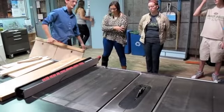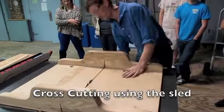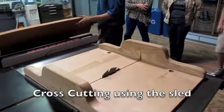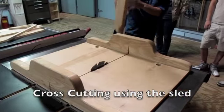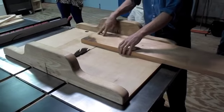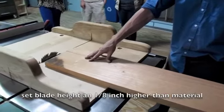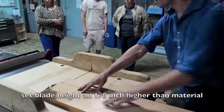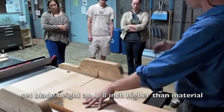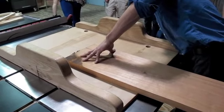This is the sled to use to accomplish this cutting. Let's say I wanted to cut off just the end of this board because it's not exactly what I want it to be. The first thing I'm going to do is set the height of the blade. Typically you want to be about an eighth of an inch higher than the wood you're cutting. So I'm just going to adjust this so it's a little bit above, and lock that top.